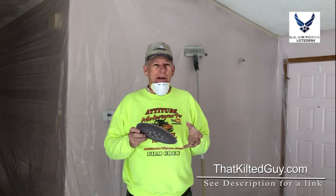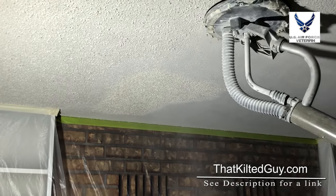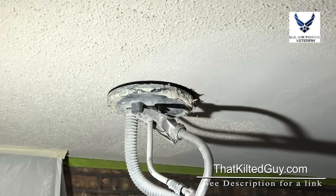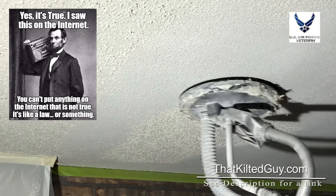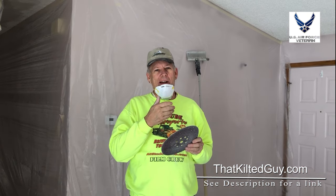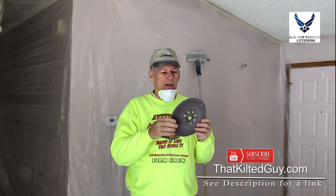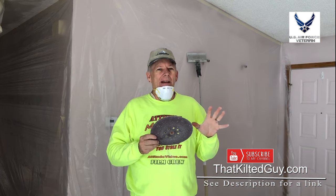I'm going to show you a clip of where I tried to sand a job that had been painted — they had painted one spot where they repaired it, whereas beside it it wasn't so painted. You'll see where I could sand over here, but when I hit the painted spot it did not touch it. So don't always take everything you see on the internet as true — it varies with the situation. If you want to know if it'll sand, go up and scrape it with your hand. If you can knock it off easily with your hand, it'll probably sand.